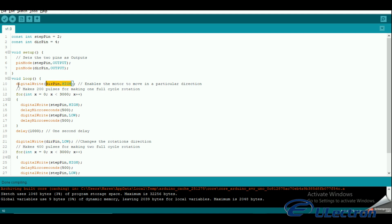Depending on how you connected the stepper motor, setting the DIR pin high will let the motor turn in the clockwise direction. To control the number of steps or revolutions, for loops control the number of steps the stepper motor will take. The code within the for loop results in one step of the stepper motor. Because the code in the loop is executed 3000 times. To control speed, the speed of the stepper motor is determined by the frequency of the pulses we send to the step pin.